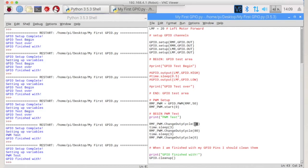So can your robot start, for example, at a duty cycle of 1 on the carpet, or does it need to be higher? What's the minimum speed? What's the maximum speed you should be going, or the maximum speed you're comfortable with going? And you can play around with what those speeds are. So create a nice big table with different duty cycles, different frequencies, testing the different frequency ranges, starting from, let's just say 10 hertz and going through to 500 hertz, and each one testing different ranges. Record your observations and see what you learn.